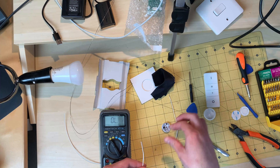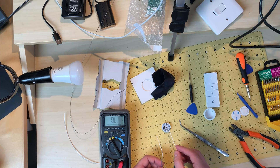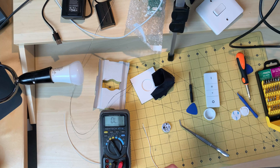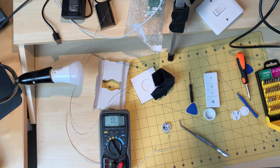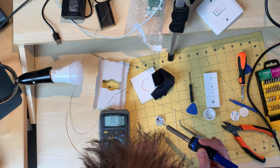So I've got my two wires here, which I have pre-tinned and trimmed. I'll trim them a little bit more because they don't need to be quite as long as they are — we don't want any more exposed core than we need. Let's do this and see if it works or if it blows up my thing.